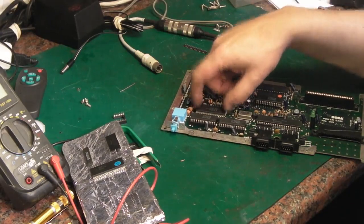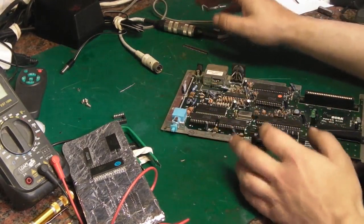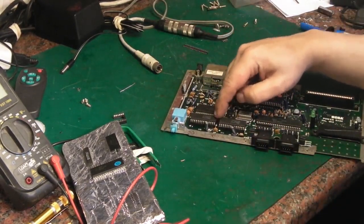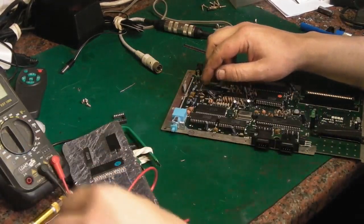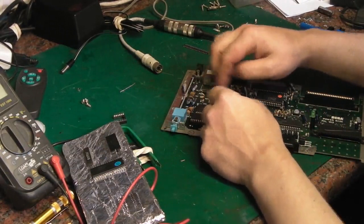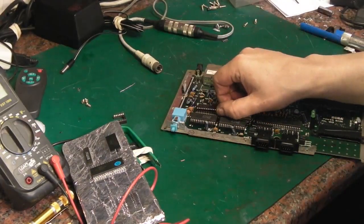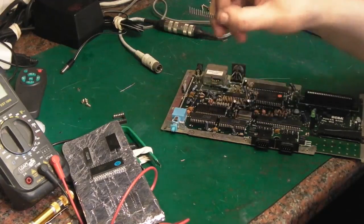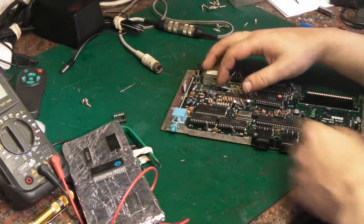And like I said, if we can take the chip out and put a new chip in. It is a little more tricky to do than with these standard dual inline packages because of the staggered pins. You have to be very careful. You have to use a tool to basically push the pins home and make sure that they fit, but it does line up pin spacing wise fine with the little pin header there. So let's get on with doing that.